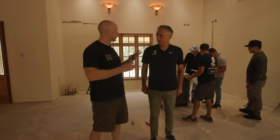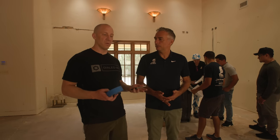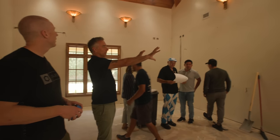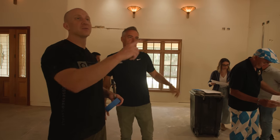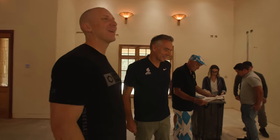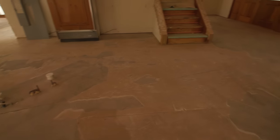I'm going to start vacuuming out the corners. What I'd like to do today is lay out the closet and master bath so we can figure out what to order. Sean's here from Britannia — we're going over the project, figuring out what we need to do. We brought the team to show them what we're up against. The process is everything comes off of this wall — you have two four-foot tiles on here that are going to be centered. When we figure out that center line, that's our line for this floor. Friday after Thanksgiving we'll be in here grinding, prepping, putting down the anti-fracture membrane — Proflex, Sim40.